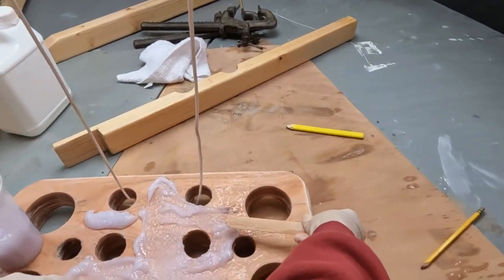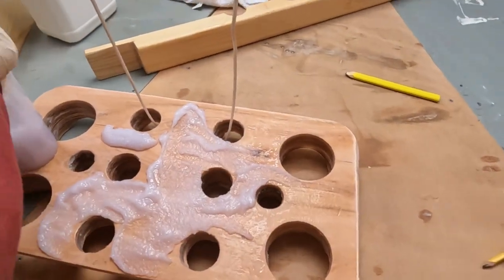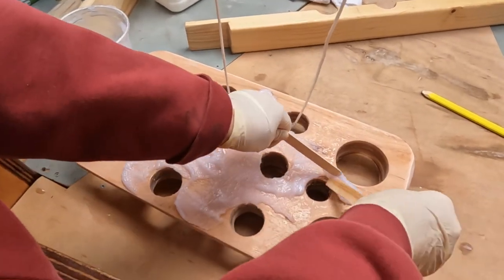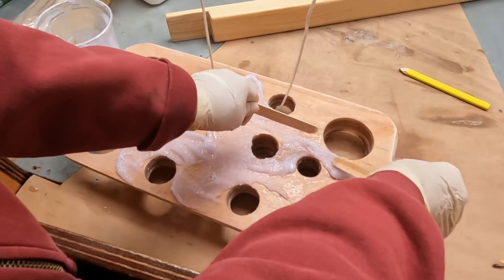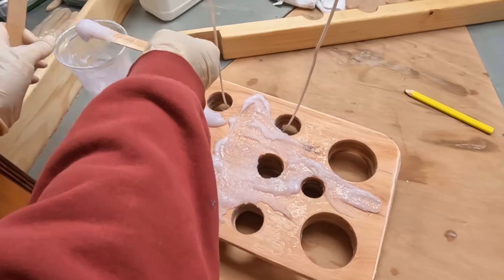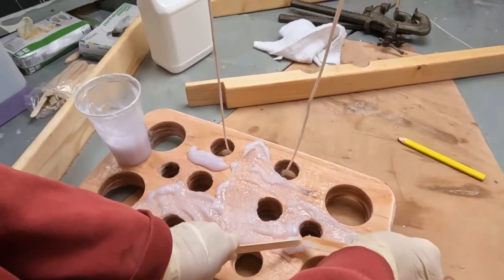It's Sunday and it's taken until nearly two o'clock for the rain to stop to allow us to fit our pad underneath the mizzen mast foot. This is the pad that Jane made - and the pad that Jane made me lighten. I took one look at it and thought, oh my goodness, that is just enormous. So we've shaved another kilo off it by chamfering the underside. We're just putting thickened epoxy on there and putting the string in place to pull it up.